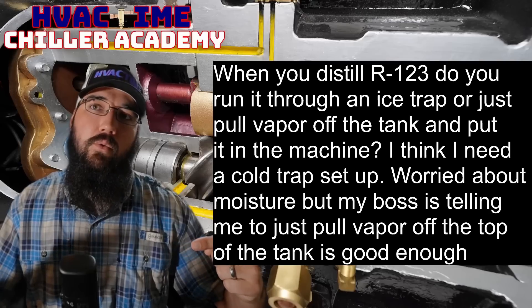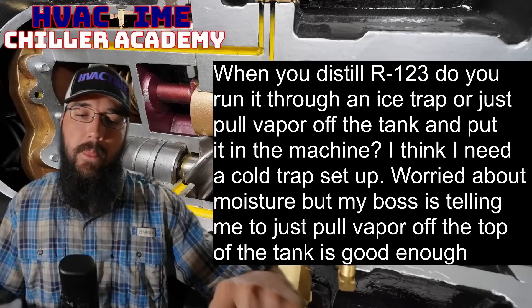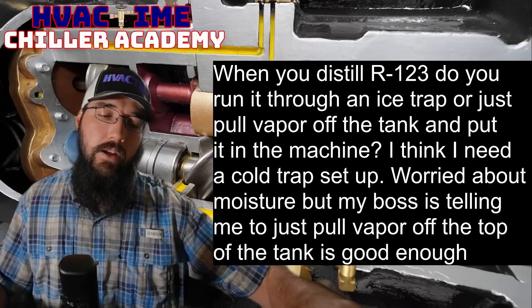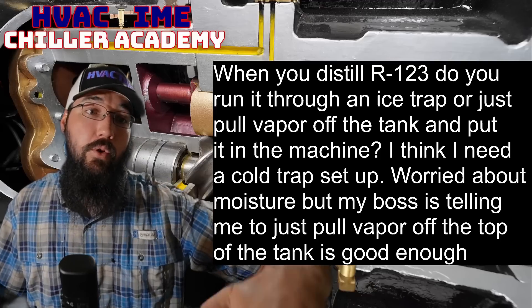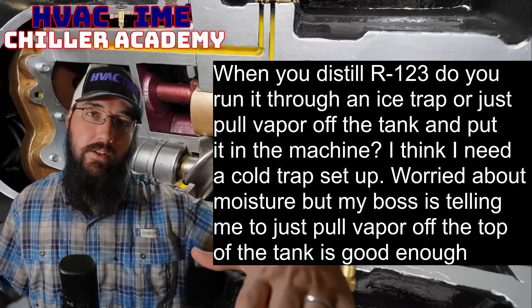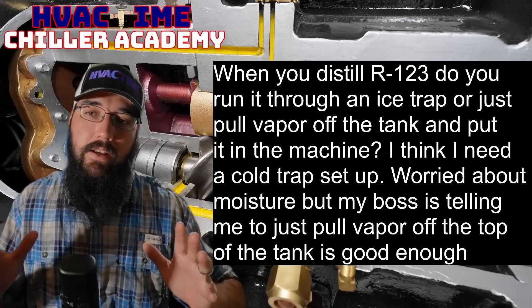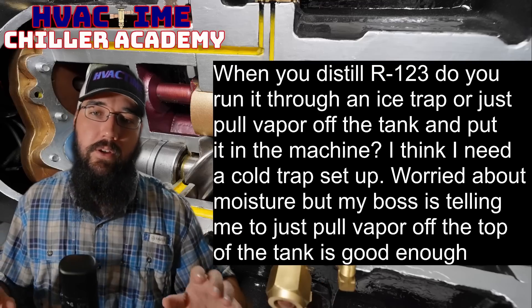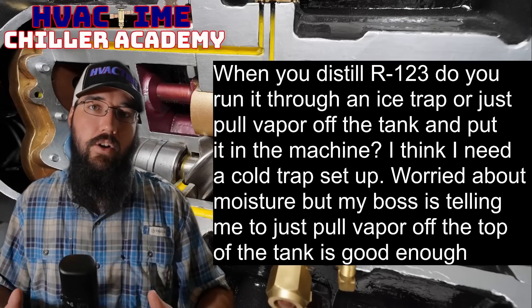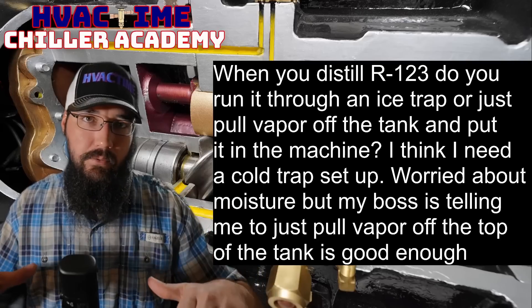So what's handy about having a dryer on the eductor system — which is an oil return circuit — is it allows us to capture any liquid water. If it's in small increments, that water would be floating on top of the refrigerant, which is where water will typically be, rising to the top. So we've got a refrigerant that they're worried has water in it. For most refrigerants, that water is going to be sitting on top of the refrigerant if it's in a liquid state — actual standing water — which can happen.